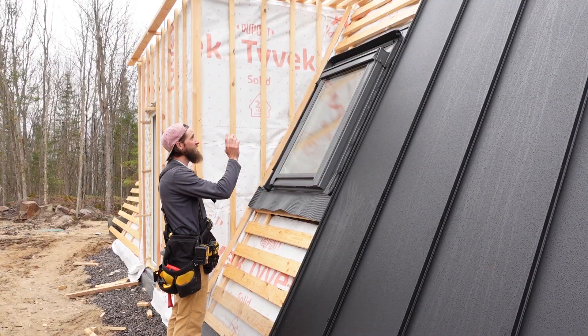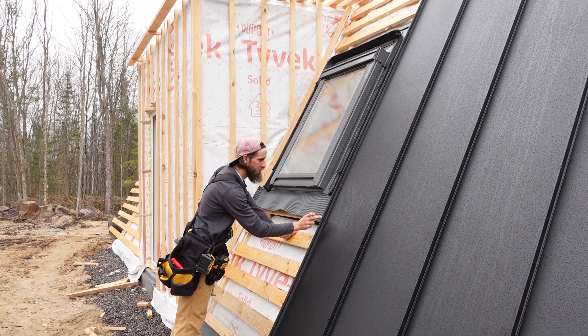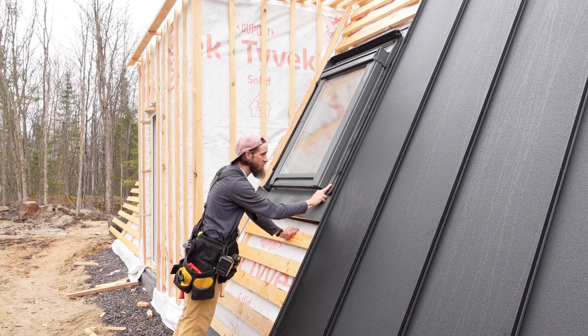Regardless of how you do those safety bends, I want to encourage you to do them — make sure you are covering up all of that exposed steel. When you get to the skylight, think about where the water is going to go, where the ice is going to go when it melts. You want to eliminate any possibility for water to make its way into your house, making sure everything is tight, fully connected, and that there's absolutely no way water can work its way into your home.